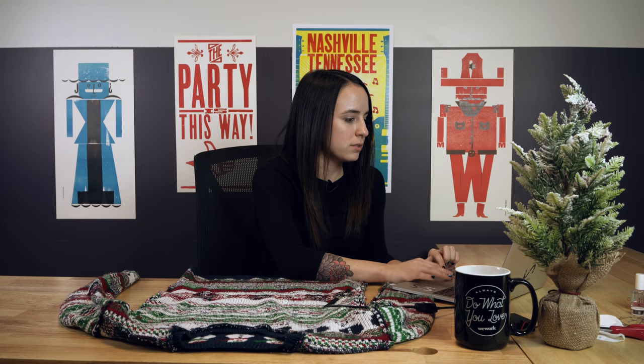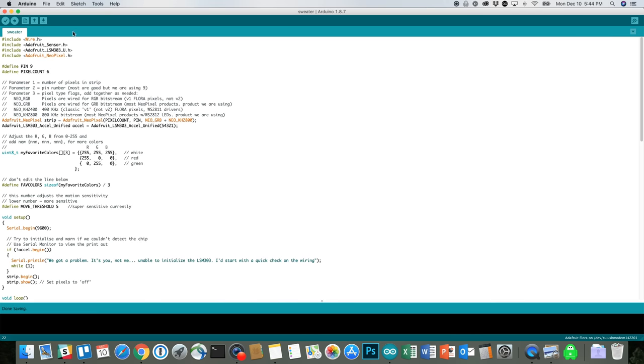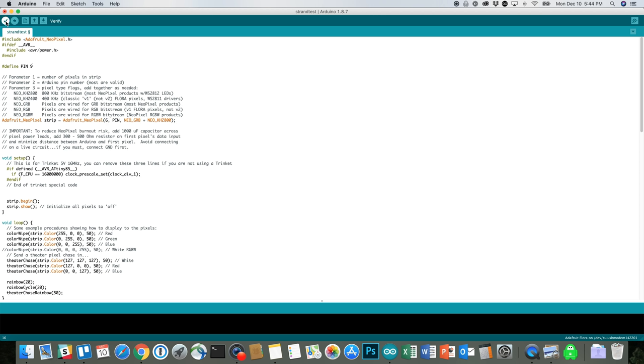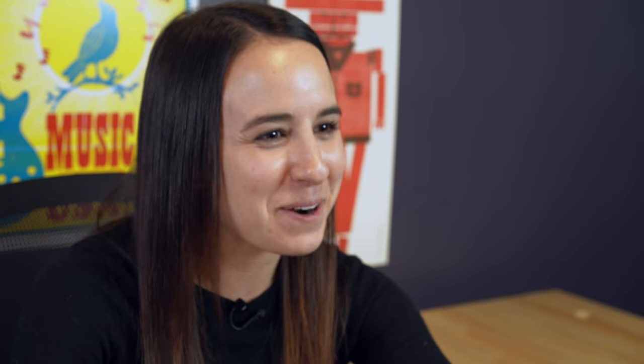Go to File, Examples and open up the Adafruit NeoPixel strand test. This makes sure that all of your NeoPixels are connected and working — if one in the chain isn't working, the ones after it won't work either. We need to update: we're using pin number nine instead of pin number six, and instead of 60 in the strand, we only have six. Update that to whatever you're using for your setup. Upload that into the Flora mainboard and once it says done uploading, flip the NeoPixels over and you can see the lights flashing and turning on. That means everything is connected and good.